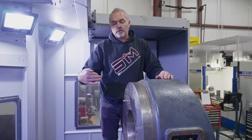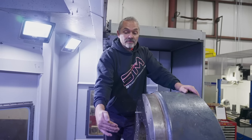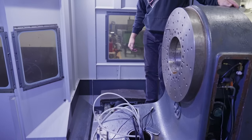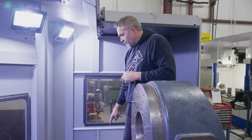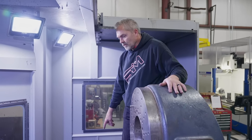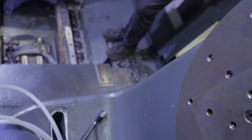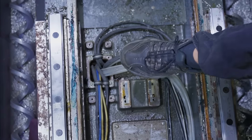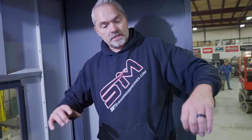Right now, the Eurotech guys — you saw in the first video talking about how this whole big trunnion table had run all the way down here to the end. What happened is it allowed this table to run over, and when it ran over fast enough from turning, this thing actually spins the ball screw — broke the flange bearing — if you want to jump over here, Nate. It's nice that you can actually walk around in this thing, this thing is huge. This is the end of the ball screw where there's a bearing pillow block bearing right up here — broke that pillow block bearing.